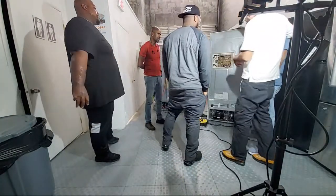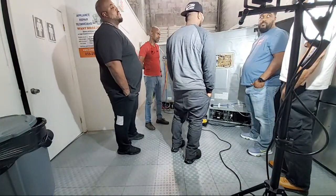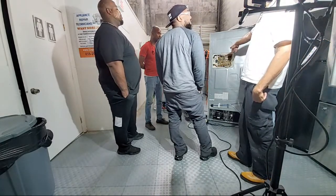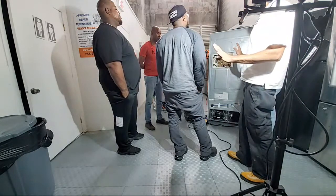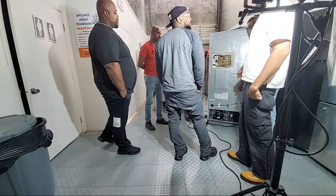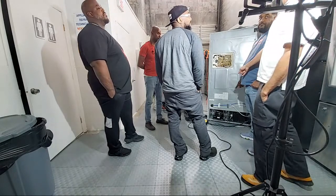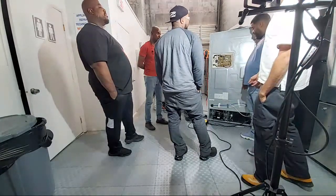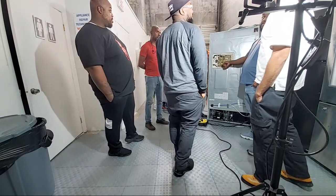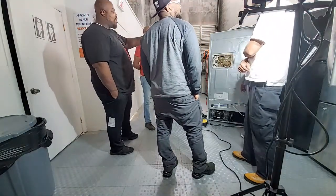Look. We get to the job, and the fan isn't spinning. We think, oh, it's either the board or the fan. We go to the board, but the board got good output voltage. Is our job done there? No. What should we do next? Check the bottom. Now, what if we don't get 12 volts here? Why do you get 12 volts at the board? It's a wire cut or something like that. You get 12 at the board and not that. You got a wire cut or something. Something's going on with that wire.